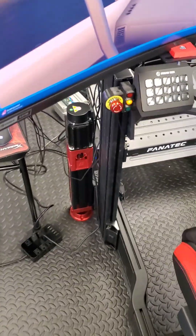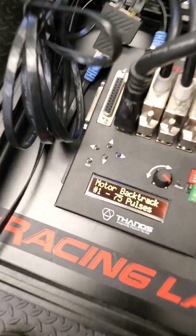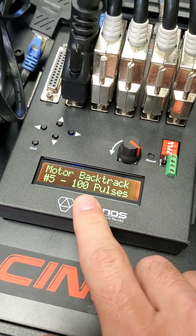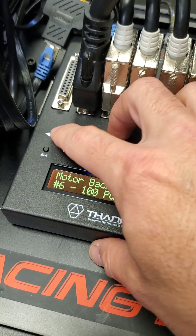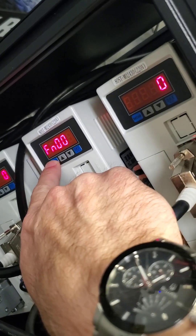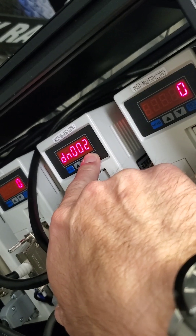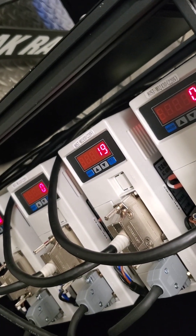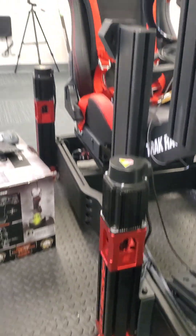This is the backtrack for these actuators — you can change it of course. For the belt tensioner, I could use even zero if I wanted, because it doesn't develop torque — it just reaches the torque and stops. Or you can increase it higher if you have a different lead screw that develops torque. You can monitor that in the DN2 — if it's below 25 percent you're good, depending on the load on the rig.